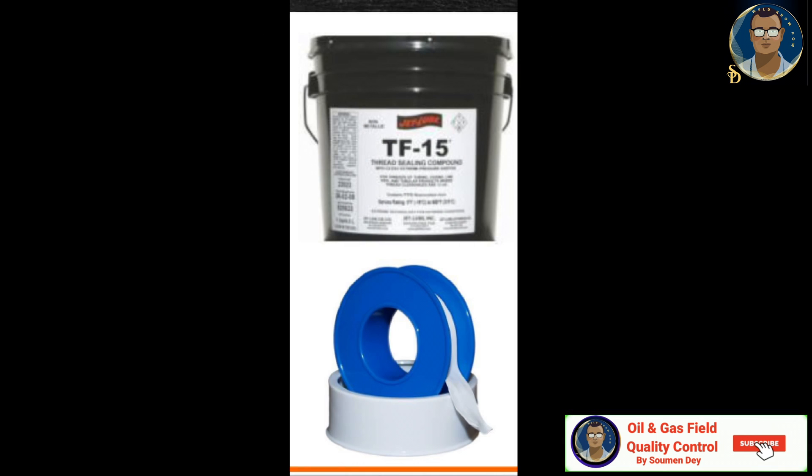The manufacturer recommends using a TF-15 thread compound. Each manufacturer has a different recommendation. Teflon tape is recommended for all liquid applications. The Teflon thread compound contains a minimum 15% Teflon with a 60 to 120 mesh Teflon particle size — powder is unacceptable. The lubricant must be API standard oil fill thread lube composition and should not be thickened with abrasives, clay, etc. Store the Teflon thread compound between 10°C to 50°C and keep away from direct sunlight and frost. Teflon tape should be 25 mm wide and 0.1 mm thick and shall contain 100% Teflon. There are two Teflon products: the Teflon thread compound and the Teflon tape, whose use will be discussed during thread makeup.